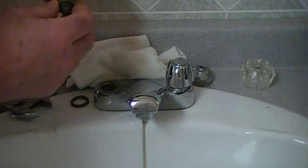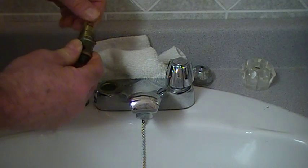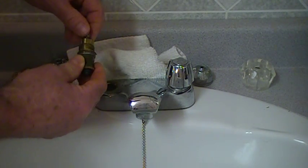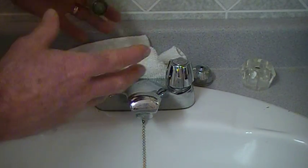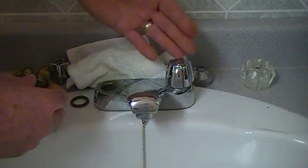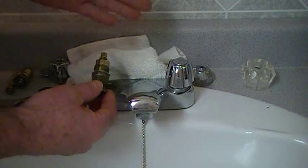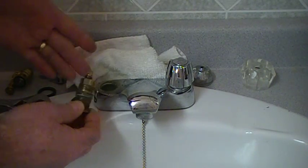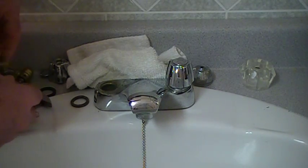This is a hot cartridge. The hot and the cold turn in separate directions, but when I'm replacing the cartridge I use cold all the time — therefore the cold and the hot shut off the same way. The only time you really need a cartridge to swing to the left is if you have dial-ease handles, which are the blade handles. You'll see them in hospitals and restaurants and so on.